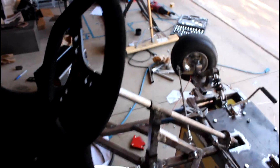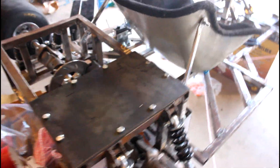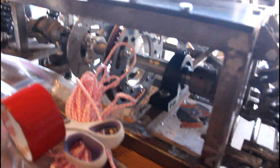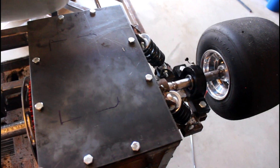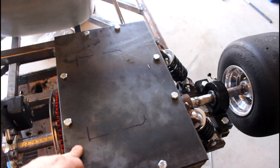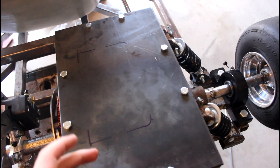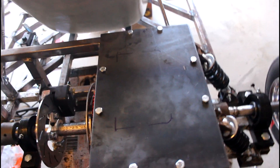Moving to the back, the first noticeable thing is the engine plate is mounted — there are eight bolts all the way through the tubing with lock washers on them. This is the mounting plate for the engine. I haven't drilled the holes yet because they're going to be oval slots so I can adjust the tension on the chain.